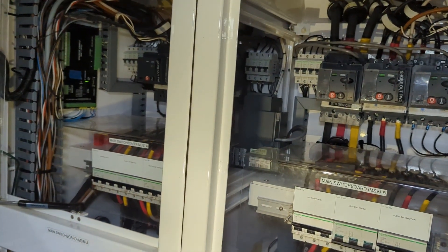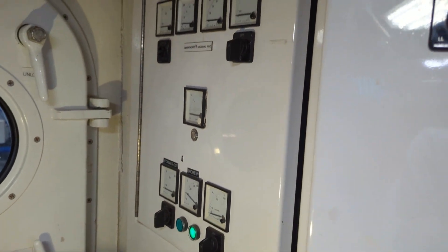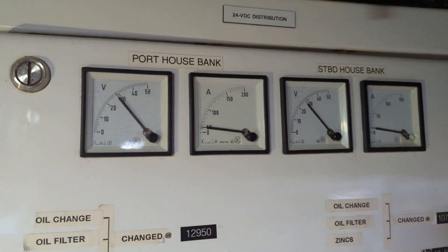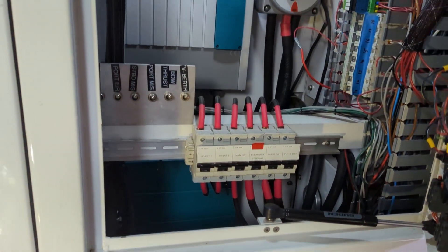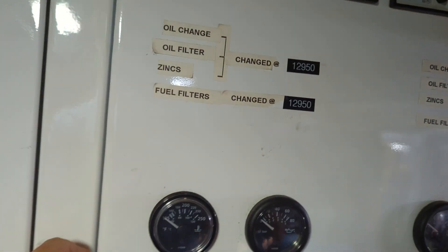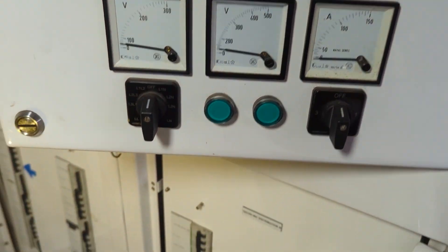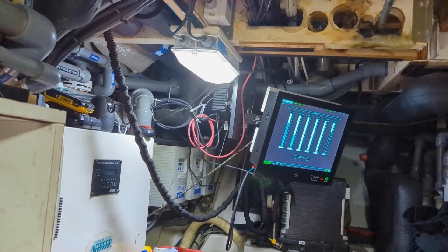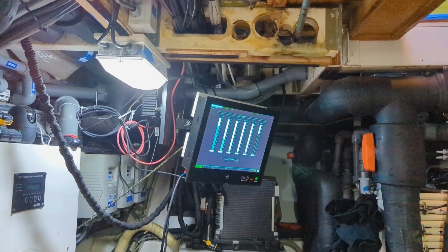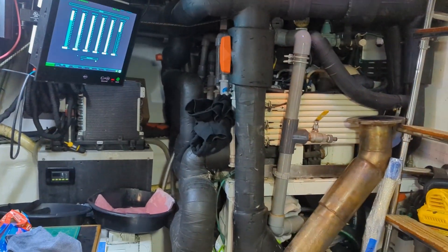Everything I thought was going to be transformed, but I'm seeing three-phase coming in to the ship from shore power — he says he's always connecting to 208V three-phase. Over here is a 24-volt distribution panel used for a variety of things on the ship. We started talking about loads: the steering motors are electric-over-hydraulic, there are refrigeration compressors, and the steering unit is probably the largest load. Every single thing on the ship is monitored — temperatures, alarms — and you can see everything from an iPad.